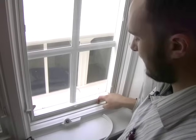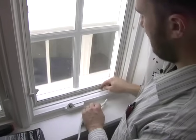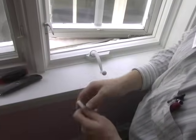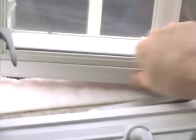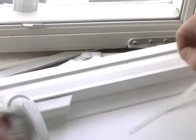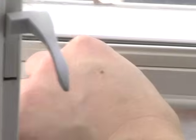We have a little gap here in the movable part of the window that I can stick my fingernail into. Just to make sure that's going to be nice and tight, I'm going to add a little bit of weather stripping in this area before we close it up. This peel-and-stick is very simple — you just peel off the backing, it's sticky, and you stick it onto a clean surface. When you close the window up, it's nice and tight and there's no more breeze.